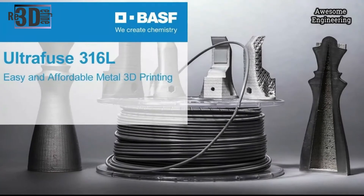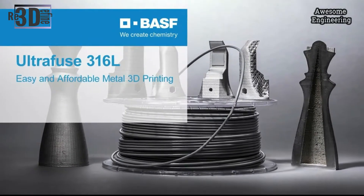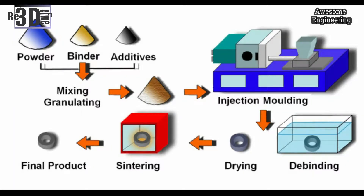Now let's get into detail on this very innovative filament. BASF 3D printing solutions launched an innovative metal-polymer composite for Fused Filament Fabrication 3D printers into the market. It enables safe, simple, and cost-efficient production of fully metal parts for prototypes, metal tooling, and functional metal parts in the simplest 3D printing process, after the subsequent industry-standard debinding and sintering.